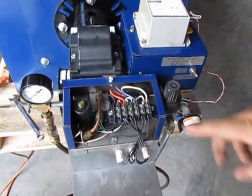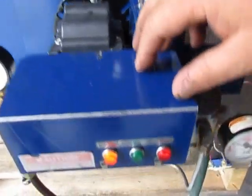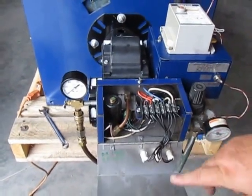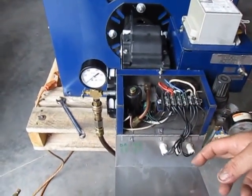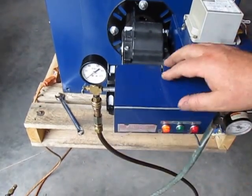The unit will not fire until the heater block is warmed up. A red light here goes on and off all day, but when it first goes out it's up to temperature. Whenever the lower thermostat is commanding heat in the block the red light will be on. Once the block is warmed up, you're ready to go.